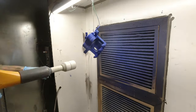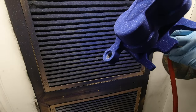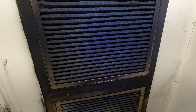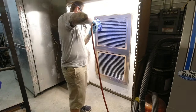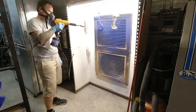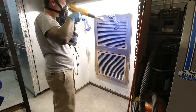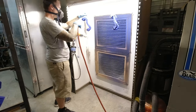Now I begin spraying these. The color I'm using here is called Illusion Royal from Prismatic Powders — super cool color with a really cool property I'll show you in a minute. I don't have any plugs or tape for masking. For something like this, I like to just use compressed air to blow off the loose powder from any spots where powder shouldn't be, which would be the inside of the piston bores and the threads for any holes. The same thing goes for the caliper mounting brackets — spray out the threaded or through holes and then wipe the faces where these mount to the spindle.